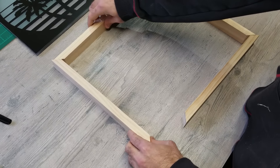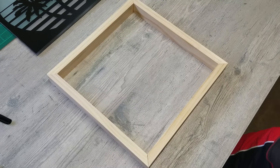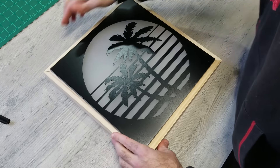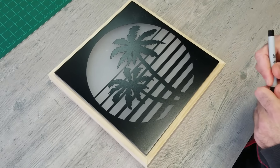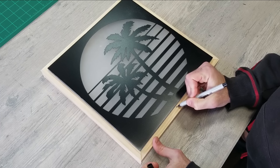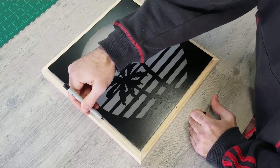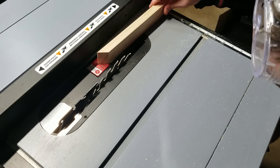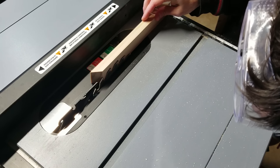After the cuts are made I'm lining things up to make sure all the cuts came together accurately with no gaps and that the square actually looks like a square. Now I'm figuring out how much of each piece I need to cut so the acrylic will be able to drop down into the wood and create that picture-frame look. I'm marking where I'll make the next cuts — keep in mind you don't want this so tight that you can't fit the LED strips in there, so I'm making the marks just a little bigger than the actual acrylic. I need to make sure the blade doesn't go through the entire piece of wood because I need to create a notch or ledge where the acrylic is going to sit, so I want about three-eighths of an inch of wood remaining at the top.